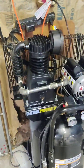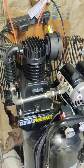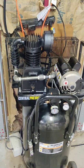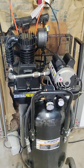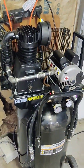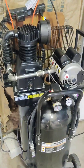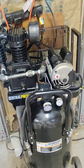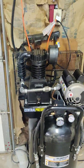The biggest thing I wanted to show was running black pipe for the connection. I've seen people run water heater hoses and washer hoses, and those just aren't going to last — they'll blow out before long just from the heat. A little bit of black pipe might cost you 15 bucks, but it's going to last a lot longer than a washer hose. Good luck guys.